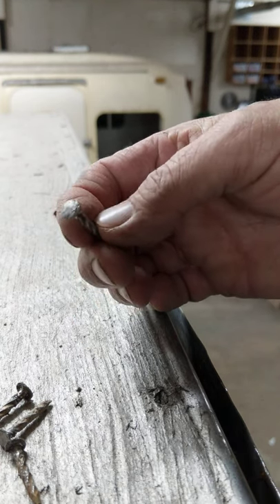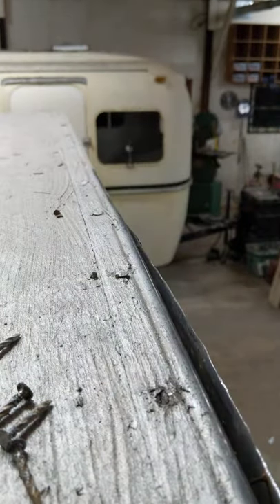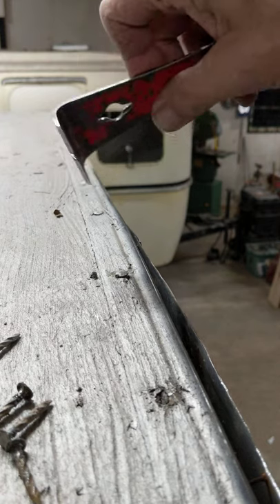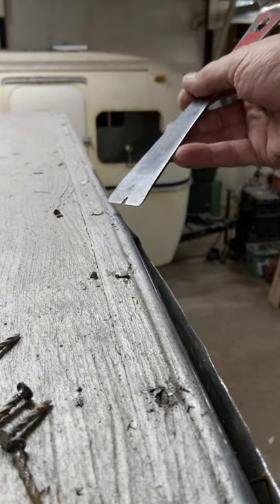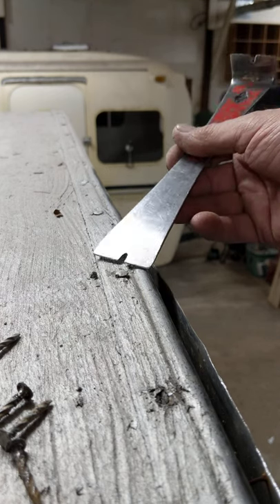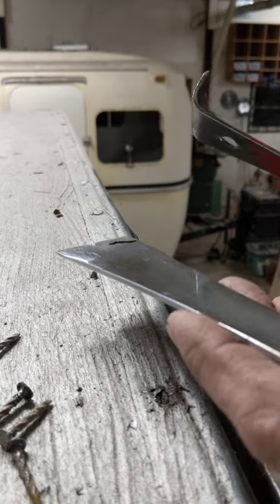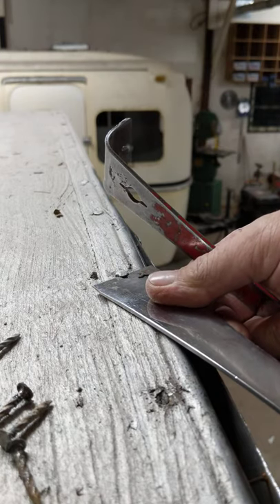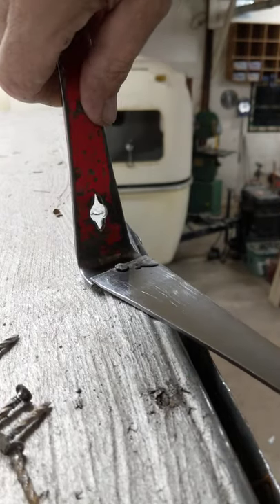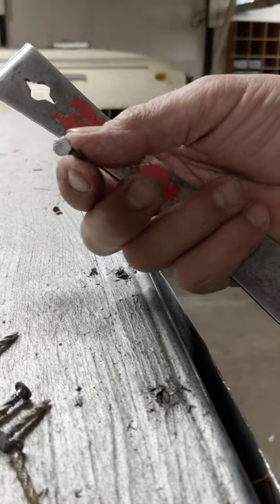So I'm pulling them out one by one and they will be cleaned up one by one. I came up with a nice little — my favorite tool — a pair of shims that I cut grooves in both ends, and these work really nicely. You can catch under the nail and slowly get it lifted up a little bit. Because they're spiral, they twist when you're pulling out, so if you just crank on them you'll actually bend them since they're aluminum. I use a pair of them — get one under one side of the nail, raise it up enough to get the second one under, then pull them up together so they come straight out unbent, and they're really easy to clean up afterwards.